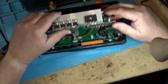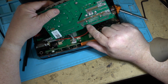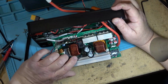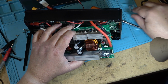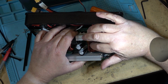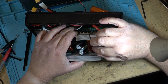So how that works is your DC power goes in from the battery onto these two terminals, one winding here, one winding there. They're going down and they're going into 3 paralleled transistors, MOSFETs. So they're switching one on, the other on. One's on at a time, one bank at a time. That creates a rotating magnetic field just because you're drawing current through one winding and then the other. And these will be wound out of phase. So you've got your north-south phase reversing from one to the other, which creates a collapsing magnetic field every time it changes direction, and you produce an AC signal on the secondary.